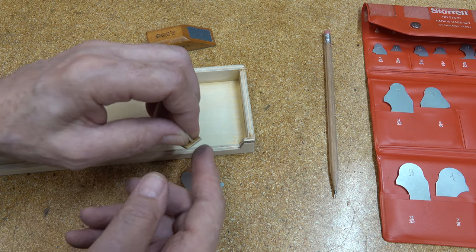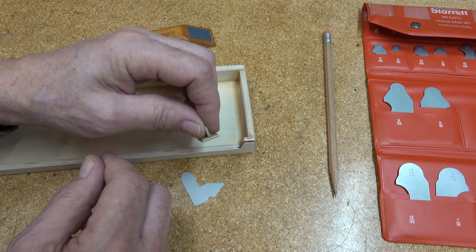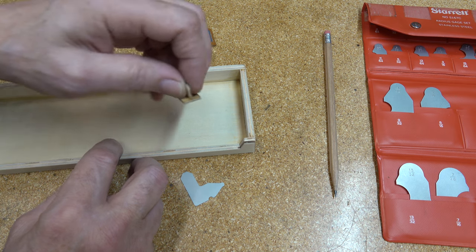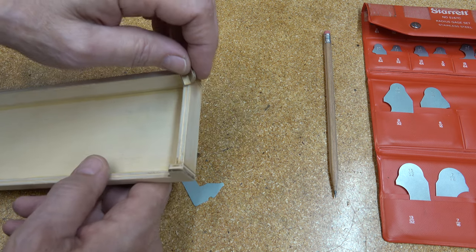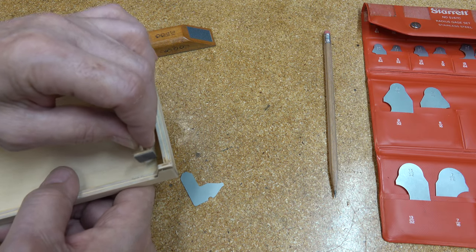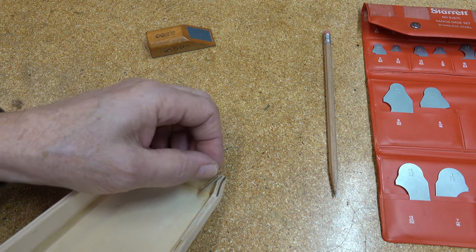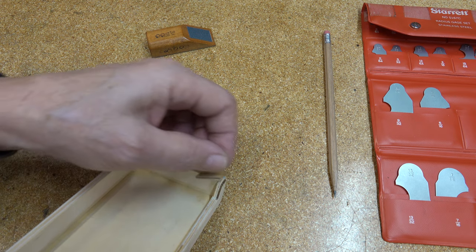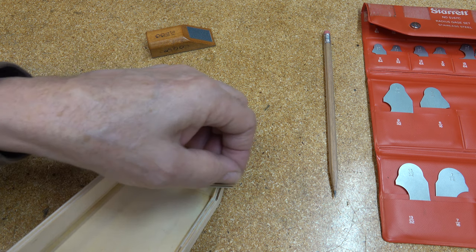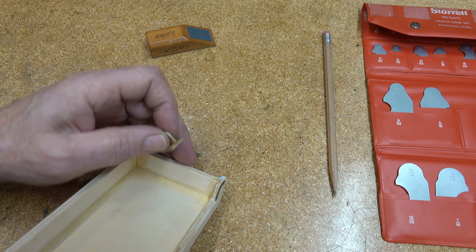And your fingers must be all the way down to the bottom. You're trying to get a low center of gravity with your fingers, as low as it can possibly be. That will give you really good control and good feel as you're doing, let's say, this piece up into here. You would always want to roll your sandpaper. Everything should have the natural roll on it if that's what you're looking to do. You wouldn't want to just do small flats if you really wanted a roll on there. You have to literally do what you would like.